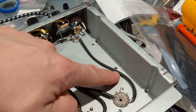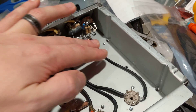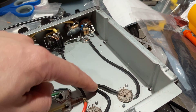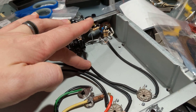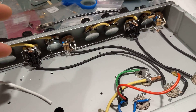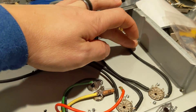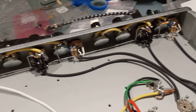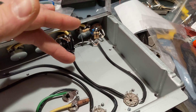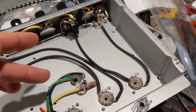You're going to see Mogami coax cable that's grounded up at the top. This is going to reduce a lot of the noise inside the circuit — this is a very sensitive area — same going up to the pot, especially running under the board. From learning about how Dumble did his improvements over Fender circuits and general modern best practices for amps, these signal paths are usually coax. So instead of going all original on that, I've really wanted a low noise floor on this. It's not going to look like cloth wire, but it's a small sacrifice for what we're going for, plus it's going to be under the board.